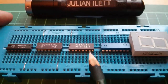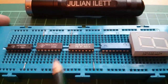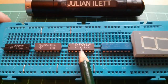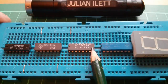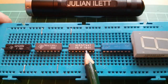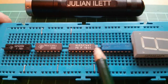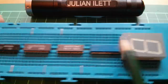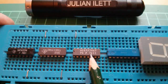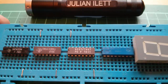Now I want to set myself the challenge of getting one of these chips to actually work. I've decided to pick this rather odd thing — it's called a 9357-7447. It's dated 1972, so it's about 43 years old. It's basically a 7447, which is a 7-segment display decoder, but it's of a slightly different family, this 9357. Let's take a look at the datasheet for that.